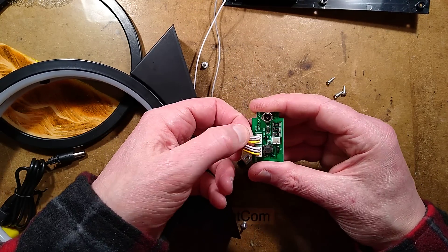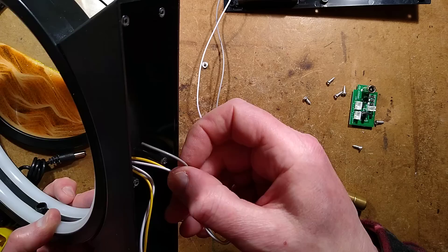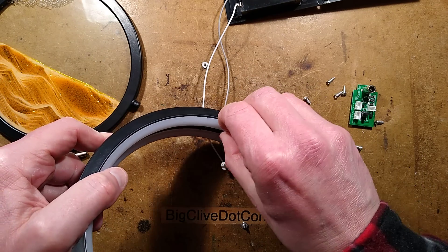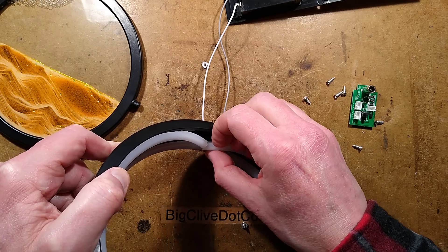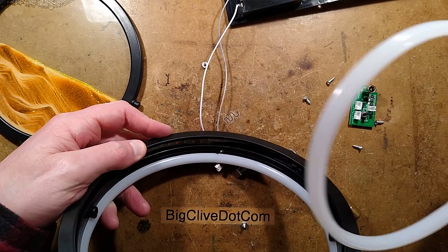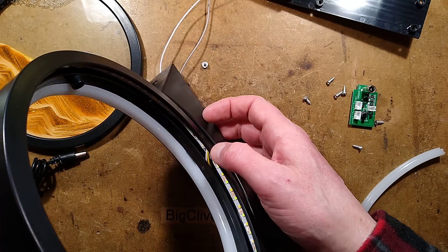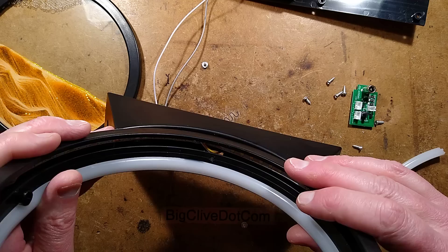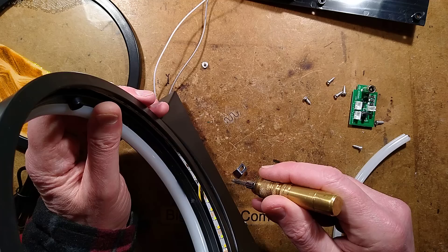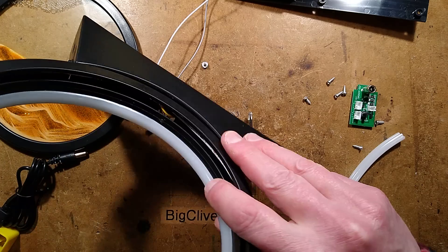Let's pull the battery connector off. I guess these have the same color and pin-out, so they're just in parallel - that makes it lovely. Where's the one that's got the wire off? It's this side. This looks like that LED neon stuff that they put into channels on LED tape, and there is the LED tape in there. I can see the two ends up here and they've connected at the midpoint so there's not too much voltage drop. I can see where the wire's off - that's going to be very fumblesome to get into. But if there's enough slack in the wires I can get to the next connection point - because it's got a connection point for each LED position you can just go one along.